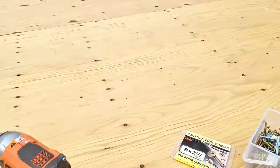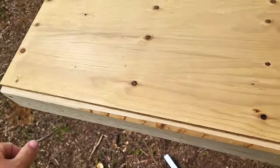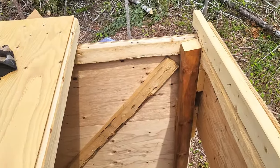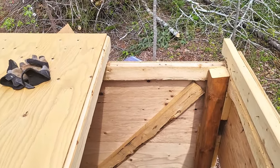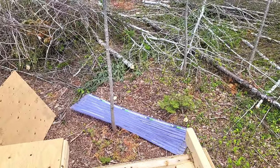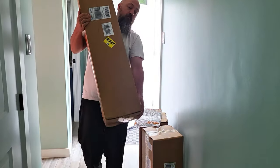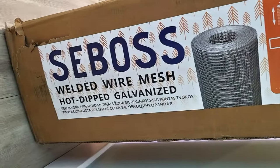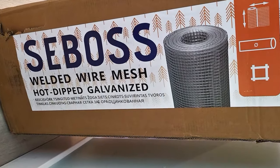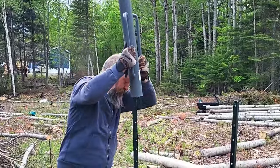We're going to be finishing the chicken coop today. I'm up here on the roof — got one more section to finish off for the plywood sheeting, and then I'm adding the corrugated roof on top of the plywood. I've got the fencing coming in early next week — going with three-foot hardware cloth, half-inch, galvanized, and seven-foot T-posts coming in as well.